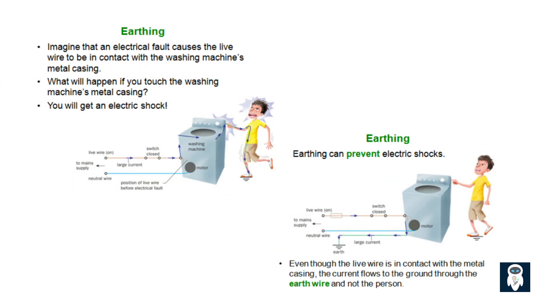Why do we spend so much time on this? Because failures in earthing and grounding systems can have catastrophic consequences. First: prevents electric shock — a properly earthed or grounded appliance significantly reduces the risk of fatal shock if internal wiring fails. Second: protects equipment — voltage surges, lightning strikes, and internal faults can damage sensitive electronics; grounding helps stabilize voltages and provides a path for surge currents to dissipate. Third: prevents fires — fault currents, if not cleared quickly, can generate immense heat, melting insulation and igniting nearby combustible materials. The fast tripping action enabled by effective equipment grounding is crucial for fire prevention.